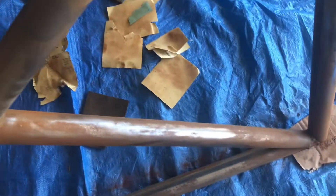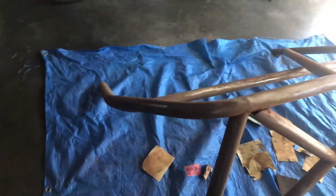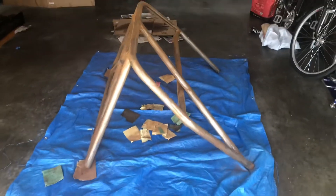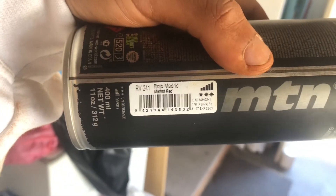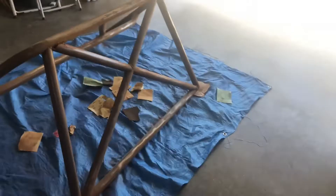There's still going to be some surface rust, but I actually work at a paint store, so I'm going to pick up some primer to go over this — just to block the rust and so the paint sticks a little bit better to the metal. We're going to pick up some primer and then throw on this red gloss — Rojo Madrid Red, hardcore paint. But yeah, it's all sanded.